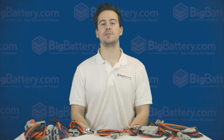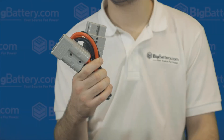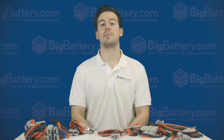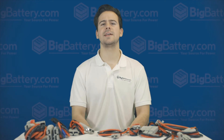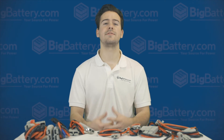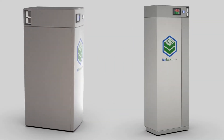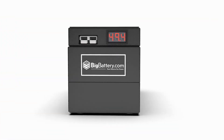Let's go over which Anderson cables we use in our batteries and which ones you might need for a DIY project of your own. We use the SB175 and the SB50 in all of our battery systems. These numbers refer to the amperage of the current that can safely pass through the cables. For most battery setups, the SB50 or SB175 will do the trick. We use the SB175 in our larger batteries, such as our power blocks, power walls, and some of our battery boxes, and the SB50 in some of our smaller power packs.